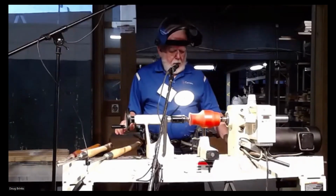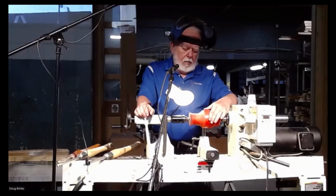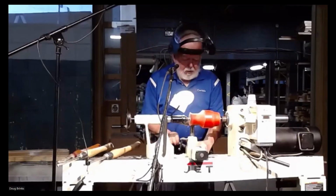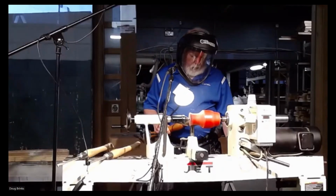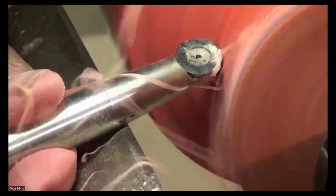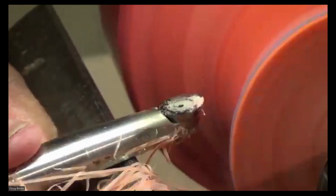I got lucky. All right, now, I would not cut with a shear cup cutter, okay? And if any of you turned much on acrylic, when it shatters, it's like a piece of glass, and it'll embed in your skin. So we're gonna come down here, and I'll use the 12 millimeter flat top. Let me screw this up. Light cut, keep moving.